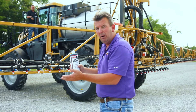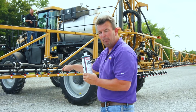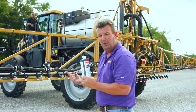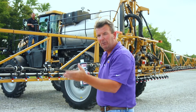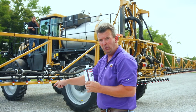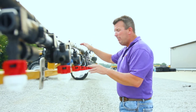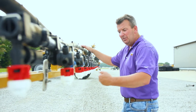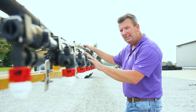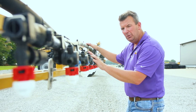The most exciting part is we're going to bring you a solution. When we show you how the new C-Series Rogator does this, you'll never have to spray product to the ground again to charge the boom. There'll be no more wasted product, no more 30 to 40 extra gallons needed every time you head to the field, and no more hot spots in the corner from over-applying while charging the boom. Our operator Brad Kretzinger is mimicking backing up into the corner in a stationary position; the boom right now is simply charged with water.